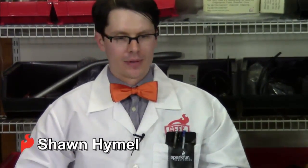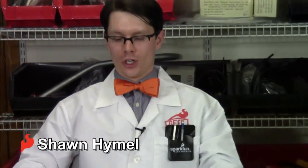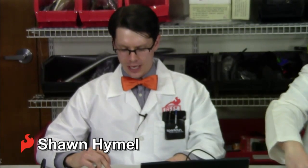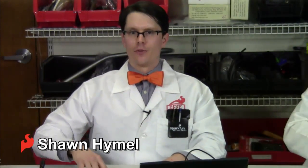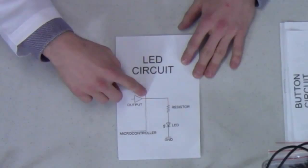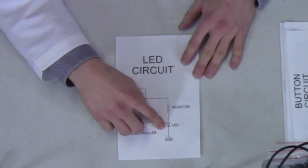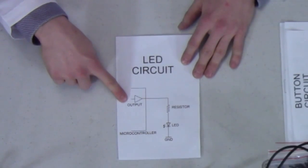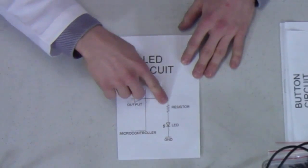Here's Sean with the build of the party button. So the first thing we want to do is attach up the big blue button. In the big button itself we actually have a built-in LED. We're going to hook up the microcontroller to a resistor and LED circuit — both of which are built into the big button. We're just going to configure an output pin from the Arduino to drive current through the LED, and that's just going to turn on the LED for us.